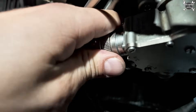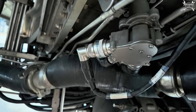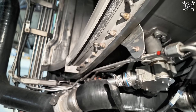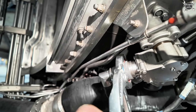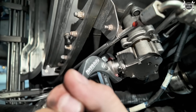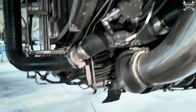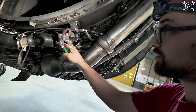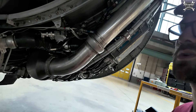Once the blue line disappears, you already know the connector is properly installed. In the end, tighten it a bit with connector pliers. If the connector doesn't move and the connector pliers slip, you know it is correctly tightened — that's why we use connector pliers, so you don't damage the connector or socket. You always tighten it with the correct value.